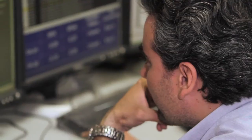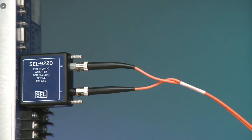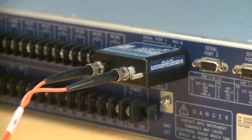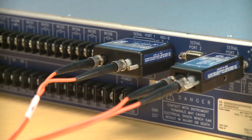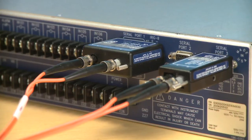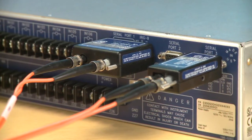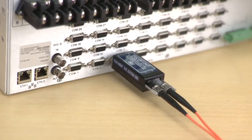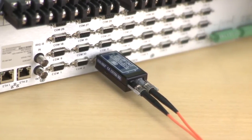Very quickly you can see that there's a need for more than the two 232 ports, and it's the 9220 connected to the 485 port that provides that third port's capability. For example, with all of those ports populated with either fiber optic transceivers or the 9220 adapter, one could be used for the RTD module, one for the excitation module, and a third for connection to an RTAC.